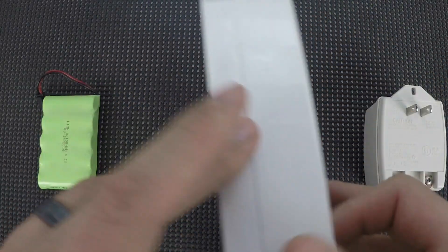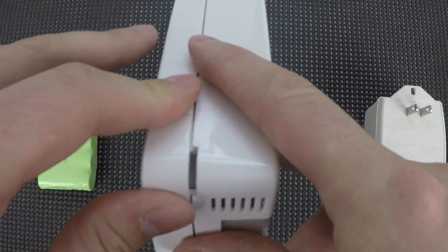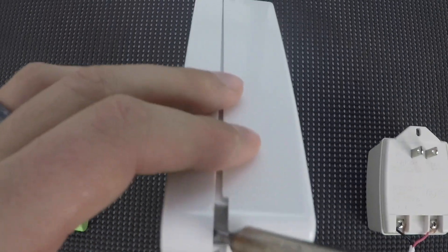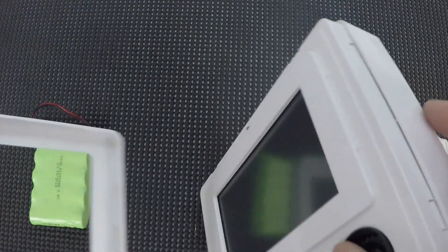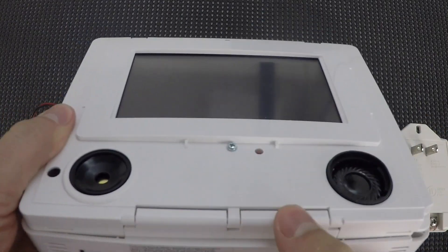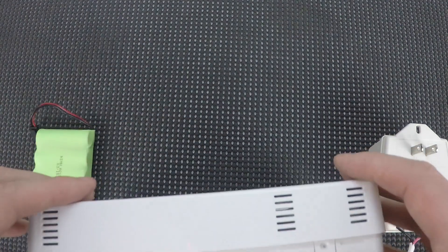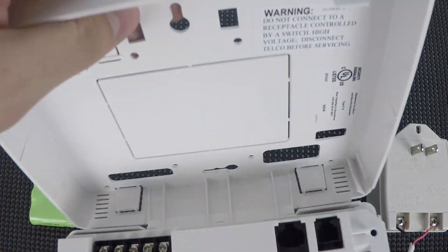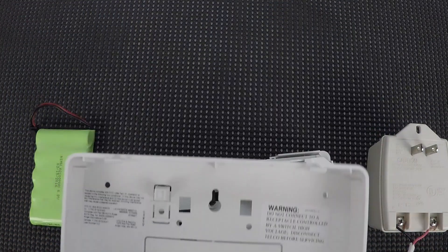You'll need to get the face plate — this has a face plate around the outside. In the bottom right corner you'll see this little notch. Some of them are a little bit tighter than others, but I recommend just getting a screwdriver and prying it open just a little bit. Once you get enough open in there, it's fairly easy to pull off. Now the system has a hinge on the bottom, so you'll open it from the top. There are two little tabs here — they don't have any screws, and they're not real tight, so it doesn't take much to pull that open. The system just pulls right off the hinge; you just lift it right off.